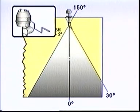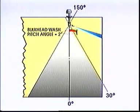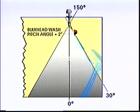The programming knob is set to Program 2. As normal operating speed of the nozzles is 2 revolutions per minute, with Program 2 selected, the nozzle will elevate 4 degrees in 1 minute. 240 degrees will be covered in about 60 minutes.